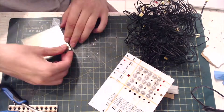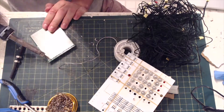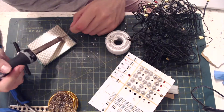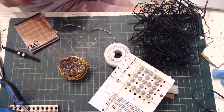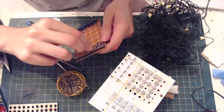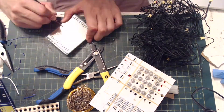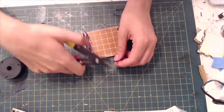I then soldered together some switching boards — one to access the wire, since I don't want to solder the solenoids directly to any board, as I do intend to reuse them. I also shorted one lead of each solenoid together, as I intend to apply current in the direction opposing the off-state magnetic field. Applying current in the same direction as the off-state magnetic field encourages the directional motion of the drops.